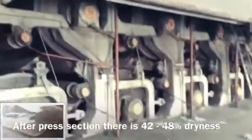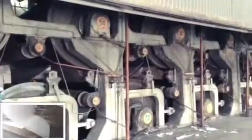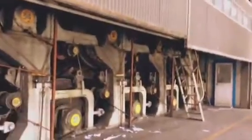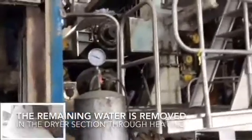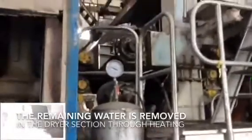In the squeezing process, we are having different presses. You have seen the rolls are moving and the web is passing through it slowly — water is squeezed out. The water that cannot be squeezed out is removed as the web passes through hot surfaces. We are drying it up to 93 to 94%. Just as we iron the cloth, like that we iron the paper.